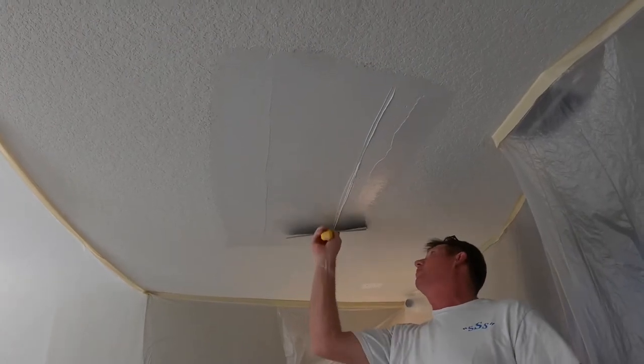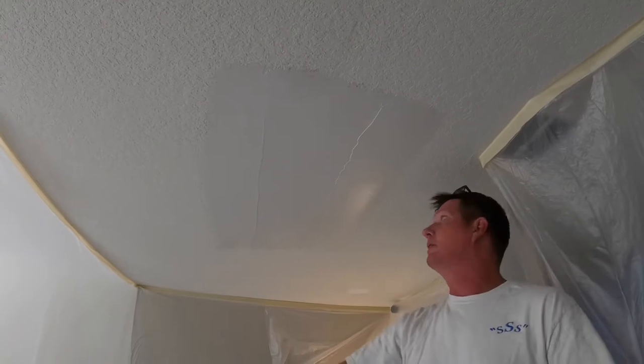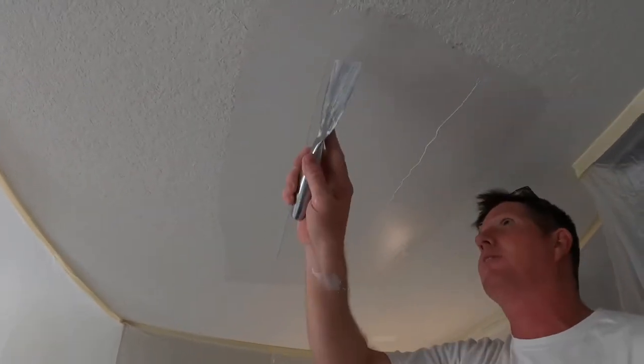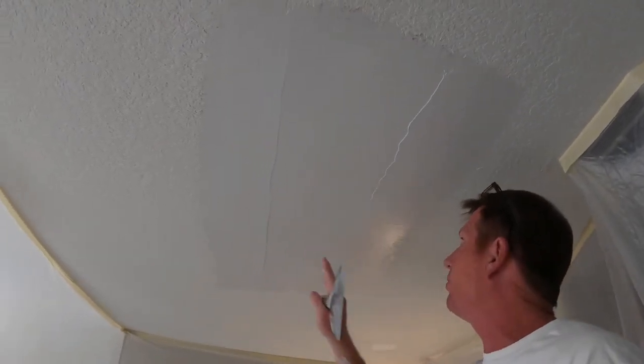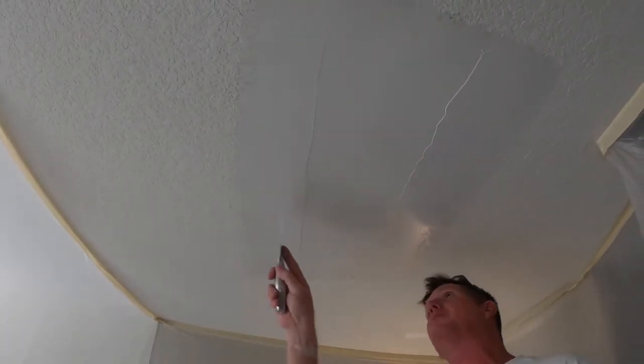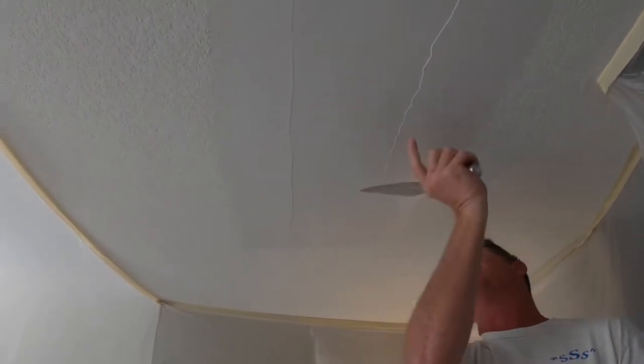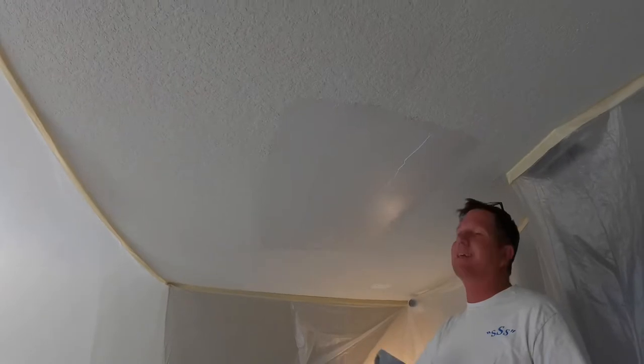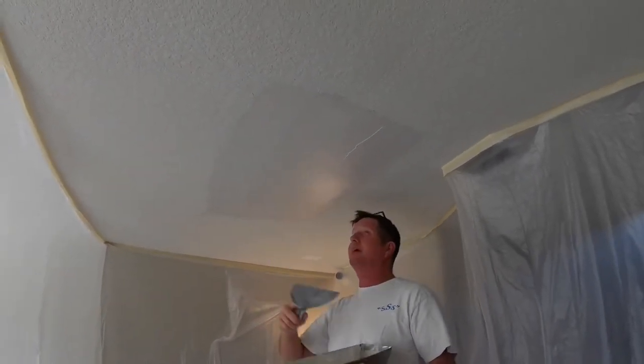Same thing on my feather edge - I'm only going to have two or three inches of the end of the knife outside, and I'm just going to lay that edge down. It's called a rollover. We'll do it one more time. The idea is to leave this lap mark outside the center, because we're trying to build the mud up on both sides. Right now my center is nice and flat, I've got these two lap marks, and that's your indicator of where your thickest mud is - that's where we need the mud to fill to give the illusion that it's flat.